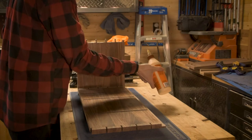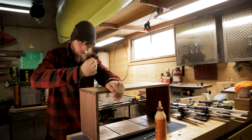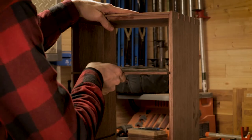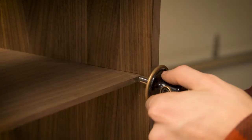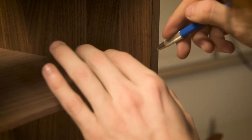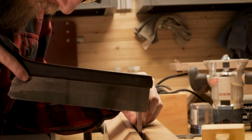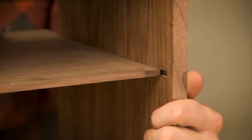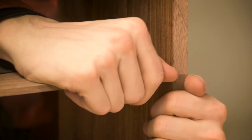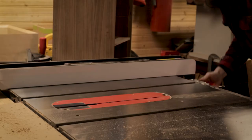For this glue up I'm just using Titebond 2, which is more than strong enough for this application. Really you're just using it to tack the dovetails together - the actual shape of the dovetails is what's doing most of the holding power. For all three of the shelves I wanted to make sure that they were flush with the front edge, at least at this stage. So I went in and just cut a small simple notch on the front corner so that they would actually line up with the front edge. Then I could go in and choose how much relief I want on the front edge - I think on most of them I went with about an eighth of an inch, so they're just slightly inset into the inside of the cabinet.